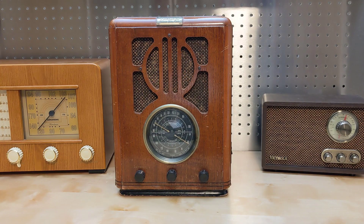On a related note, you often see modern reproductions of old radios. They regularly show up on auction or classified ad sites and may even be described as old tube radios. They may have what appears to be a known maker like Curtis, Crosley, or Victrola. While these can look nice and be safer and more reliable than a vintage tube radio, they are not vintage tube radios. Here are a few ways to detect a modern reproduction without opening it up: the presence of modern features like a cassette tape, Bluetooth, or USB support; the presence of an FM band, meaning it was made since 1948; and stereo FM would mean no older than the 1960s.